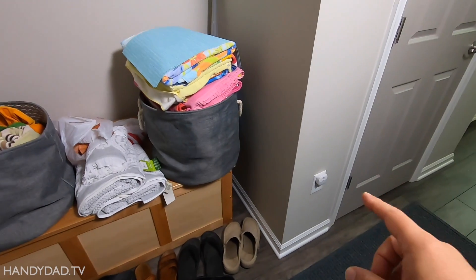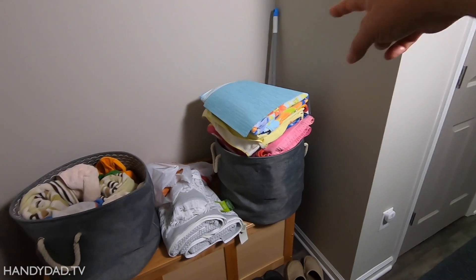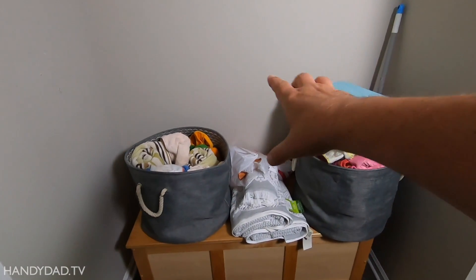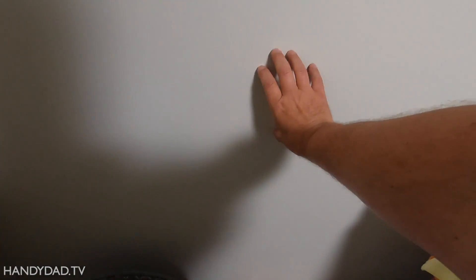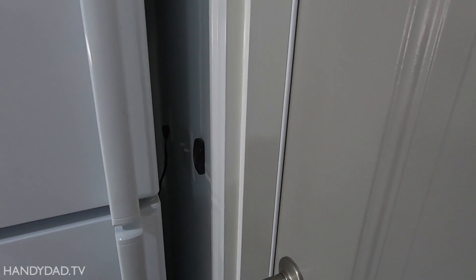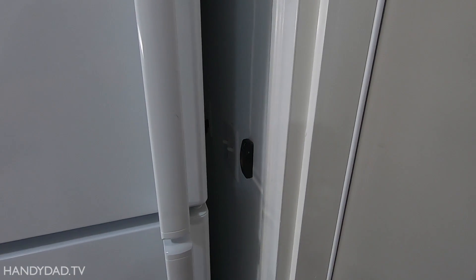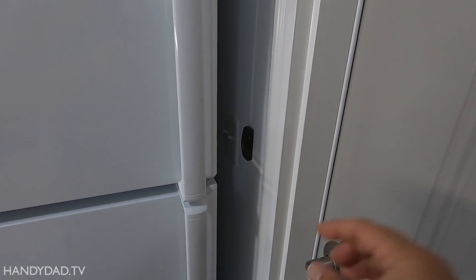I've got a couple choices. One is to take power from this outlet here and run a wire through the wall or through that pantry cabinet there and bring it down. I really want the outlet right here, right above the countertop. But I have another alternative — inside the garage, there's an outlet over here, and I believe they're on the same circuit. It's not going to be for anything with high current draw anyway, just for convenience. So the easiest thing to do is take power from this one, run it down around where my cabinets are going to be and up to the new one.